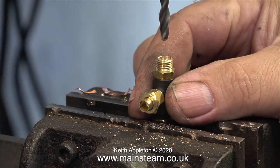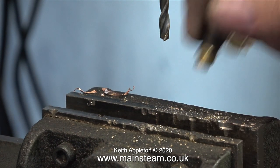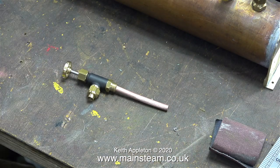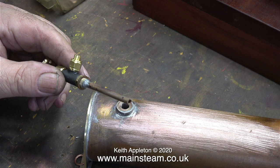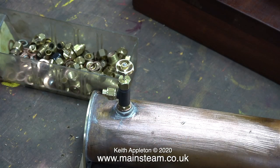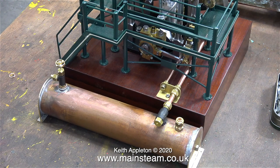Time now to turn my attention to the drain tap. I need to solder a pipe into this — three-sixteenths of an inch in diameter. Here you see me drilling a hole in the steam tap to accept the pipe. I cleared all of the swarf out of the tap and then soft soldered a piece of three-sixteenths inch diameter copper pipe into the base of the tap. This piece of pipe reaches all the way down to the bottom of the condenser and is used for draining the condensate. Here I'm using a shim washer to make sure that the tap's outlet is in the correct position. Here's a shot of the finished condenser.